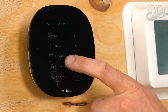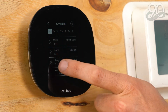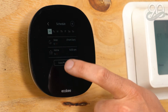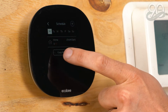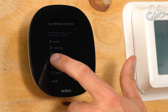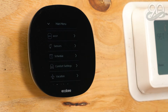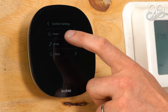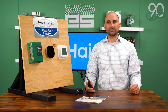The fourth setting we can change is the schedules. Normally, we delete the schedules and leave one — it doesn't matter if you leave Home, Sleep, or any of them, we just need to make sure there's one. Once I've created one, I delete the others, copy that day to the rest, and save. So every day is now only on Home. If by chance the thermostat runs the schedule, it's only going to run one schedule, and we'll change that setting to 66 degrees. Once you've completed these steps found in our installation guide, we move on to setting up the integrated controls with the IFTTT program.